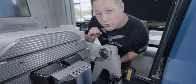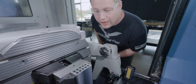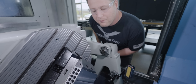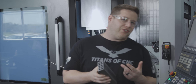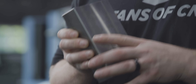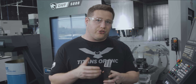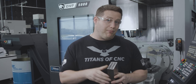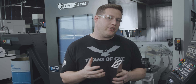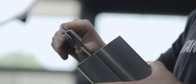We just drilled 10 holes at 12xD without a pilot drill and the holes look really great on the top, but how did they do on the back side — did it taper? Now this is 1018 steel, which makes this a little more difficult because it's so gummy. The chips were looking really good, staying really small, which is a very good thing when you're drilling something this deep. The drill sounded good and made good chips, but the real question is how does it measure?